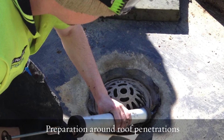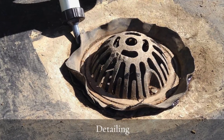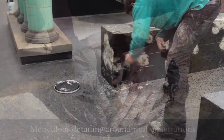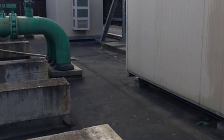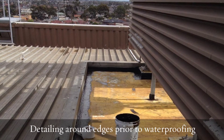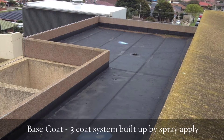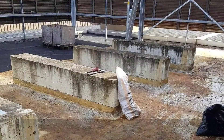This coating ended up being quite a number of coatings involved, so we did a three-coat system on this and built it up in slow layers just to get a nice thick coating on it. We went further into detailing all the hobs as well — even though they weren't being used, they were an obvious point of water ingress by saturating the concrete, so we went ahead and did those as well.